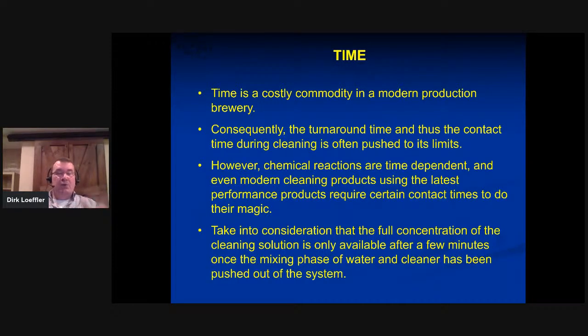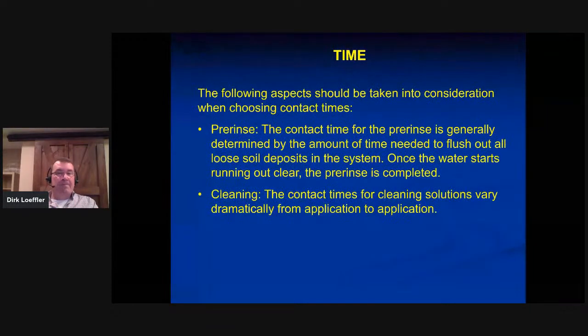Important to understand: you sometimes have mixing going on in the pipes, so when pushing out from a cleaning cycle you don't have clean water until a few seconds or minutes into the cycle because you have to push the chemical out of the system first. Pre-rinse time rule: the pre-rinse is done when the water runs out clear — simple as that. On the cleaning side, depending on the chemical you can use phenolphthalein for caustic — keep in mind if your water itself is alkaline that might not work so use conductivity. For acid, you can use conductivity, pH, etc. There are definitely things you will be able to save.